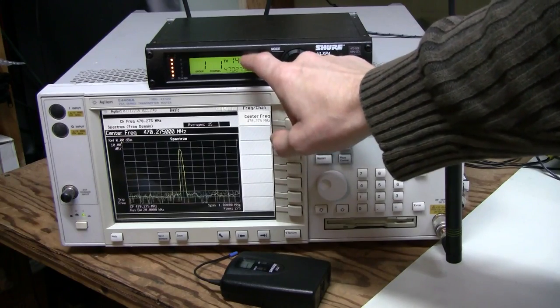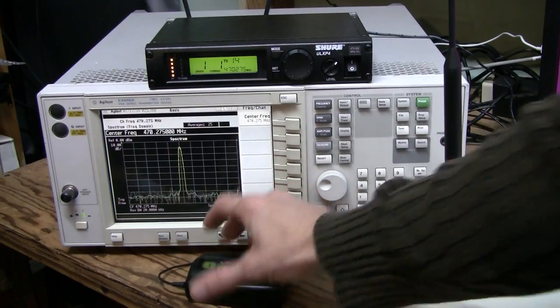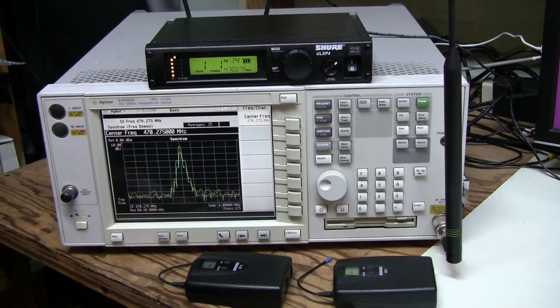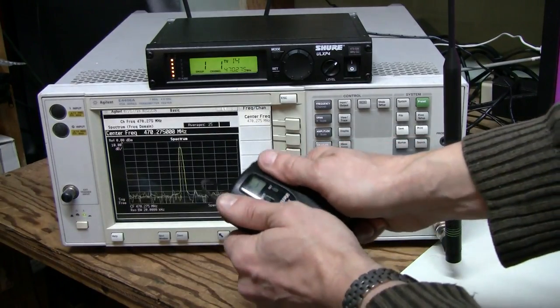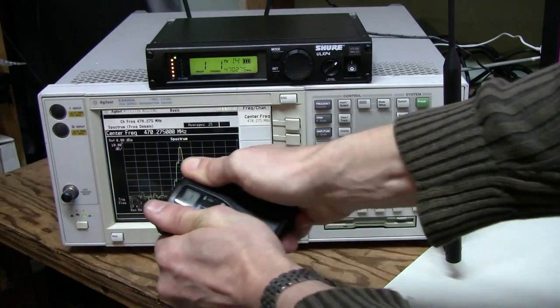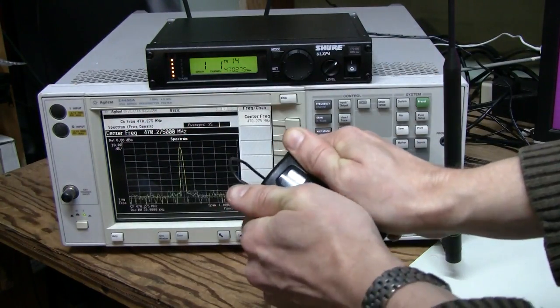The battery indicator must be transmitted somehow — I'm not entirely sure how exactly. Let's turn the faulty unit off and try the working transmitter. We have the carrier and modulation as well. Interestingly, I noticed that when I push on the case of the faulty transmitter, sometimes I can make it work — modulation appears along with the channel indicator and battery indicator.